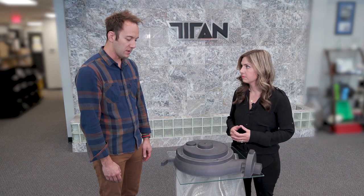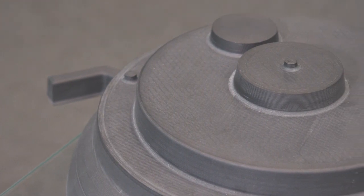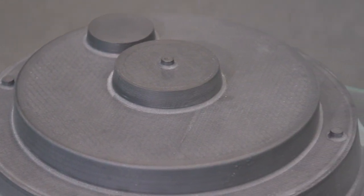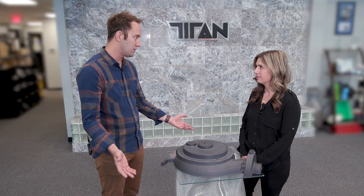This is kind of a groundbreaker for a lot of tooling applications. A lot of our foundry customers are using the hybrid additive and subtractive system. Traditionally if you have a CNC machine you don't necessarily need this, but some foundries find it appealing because it's a two-in-one combo — you can print and machine on the same coordinate system, with no need for a setup, which enables lights-out manufacturing of this part or any tooling part.